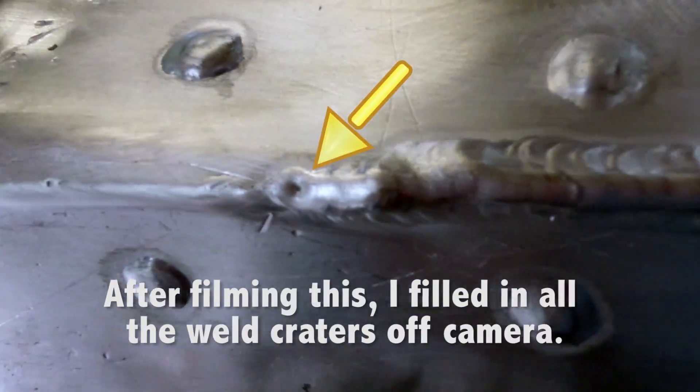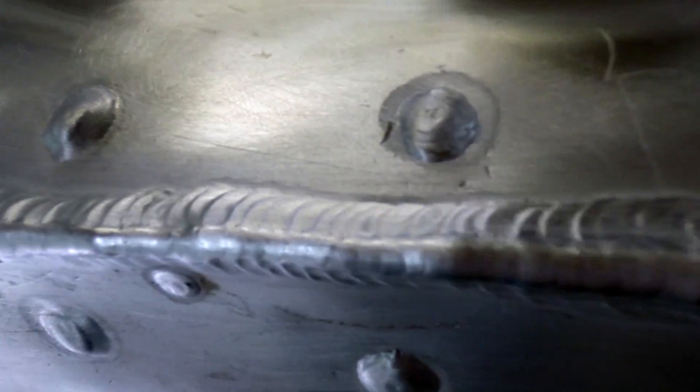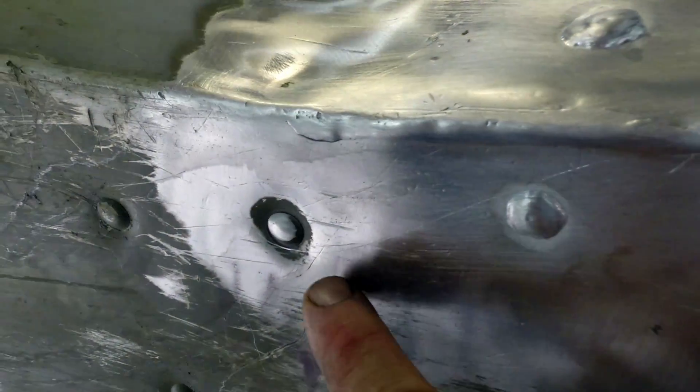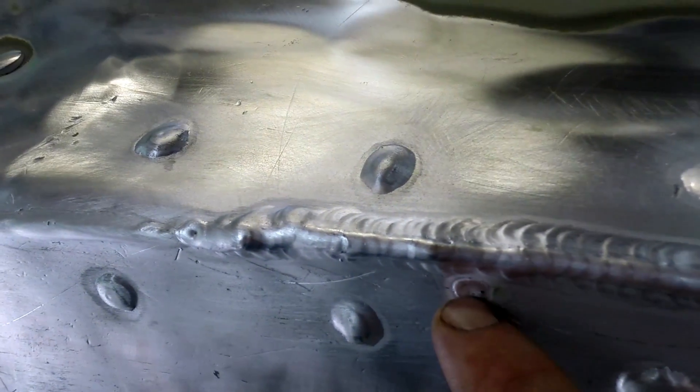Here's the finished product. When I got done and got all the way to the end, I had a real good weld. What I did is I just went and lit up on it with a torch again and contoured it so that it kind of matched the existing body line of the boat. It wasn't necessary — it was plenty strong — just me being particular. This here is a rivet, and these are the actual holes that we filled in the boat. There was a little tiny crack right there we also filled. Here's a shot of the inside. There's a lot of crap in the weld seam that was there, and I didn't want to get in there with a grinder and grind it out and make it too thin and difficult to weld. It's a pretty good weld — not the prettiest thing ever — but considering what we're welding over and trying to repair, I'm very satisfied with it. The rest of this boat will come apart before that spot does. Good as new. Can't beat that for a Craigslist find.